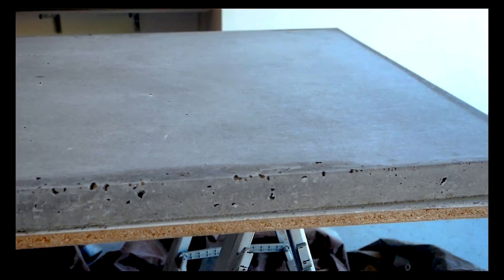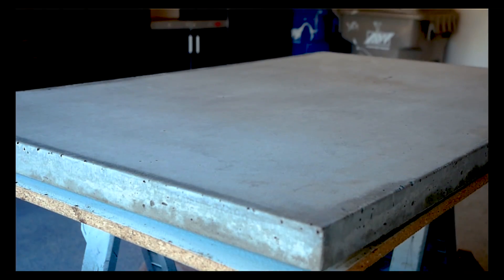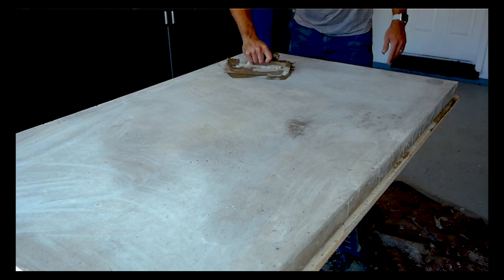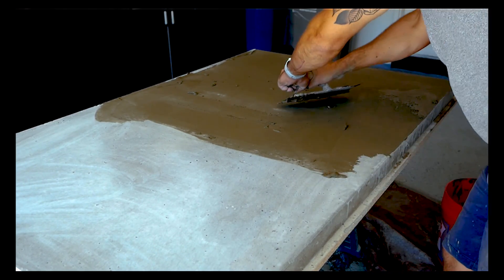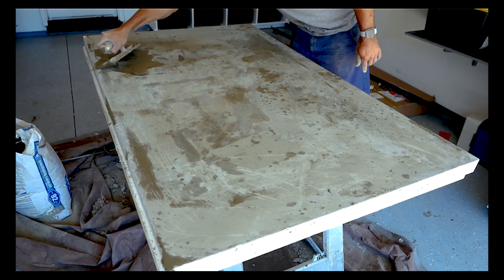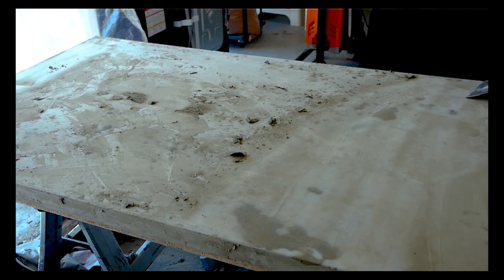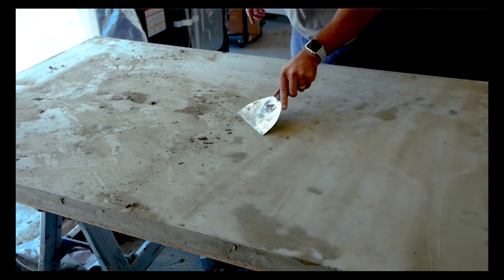At this point you'll probably notice not all voids were filled, but don't worry — there's a way to fix this. Pick up a bag of Portland cement from the hardware store, it's like five or ten bucks. Mix it up to the consistency of pudding and start applying it like you would wood grain filler — a slim, thin amount on top, pushing it into all the little holes and voids. Do that a few layers; doing the entire slab helps speed up the process. Once it's dry, scrape it off, apply another coat and scrape again. Then take a six-inch finishing drywall knife and scrape all the dry stuff off the top to ensure you don't pull any material out of the pores.